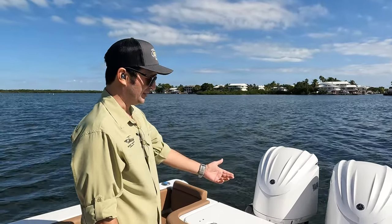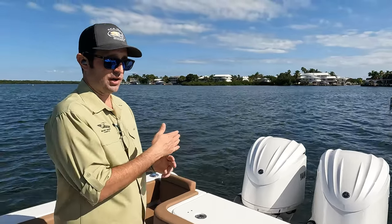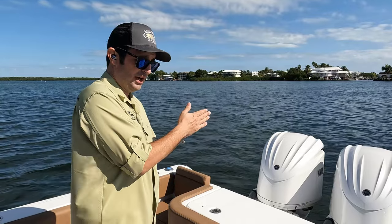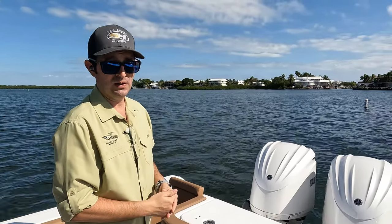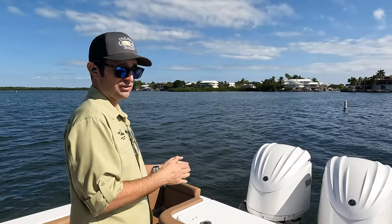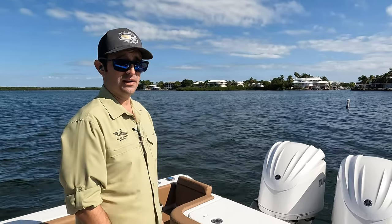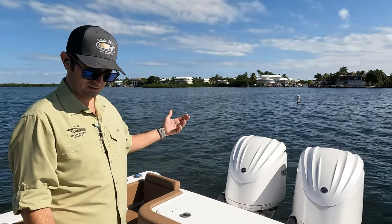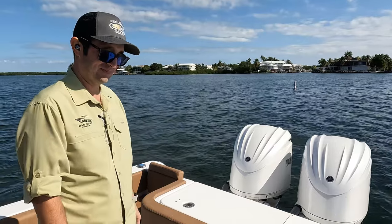It's a very proven technology with the electric steering. You can program what's called lock to lock, how many turns it takes you to turn from full left to full right on this boat. And you can change that at different RPMs as well. Wow. So if you're going slow and you want a lot of response, we can make it 4 turns. And when you're going full speed, we can make that 11 turns. Nice. And so those are all the things that you can do now that you have electric steering computers.